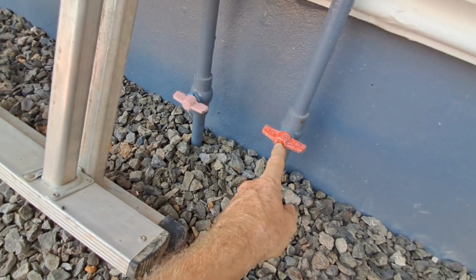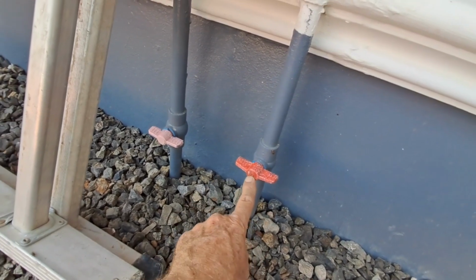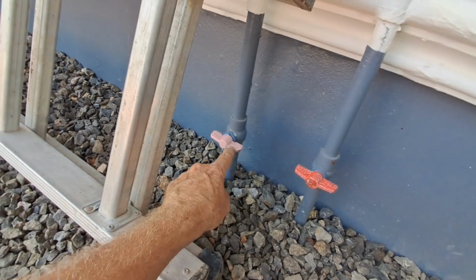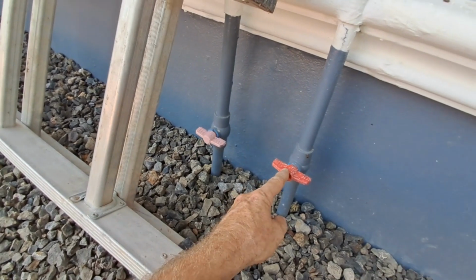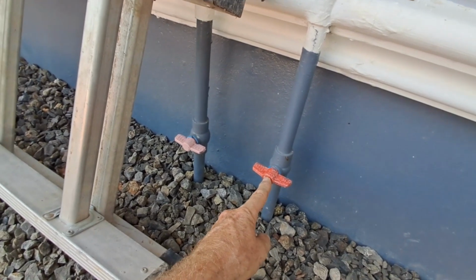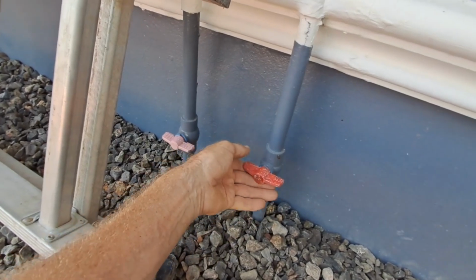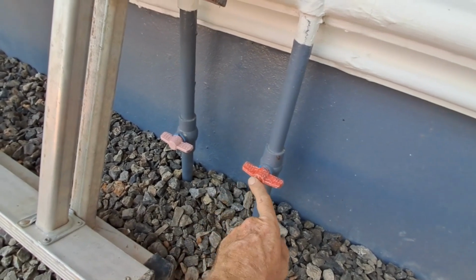And I'm not surprised because this valve is the only one I've got now, I think, of this actual make. And this cap comes off here, which distinguishes it from the other makes where this handle and body is all one. But for some reason this is a slightly different design, and I think it's screwed in through here because the cap does actually come off if I get a sharp knife, and I can lever that cap off, but that's definitely got a little bit of a weep. Well, it did when I turned it, and it certainly is coming out of the cap.